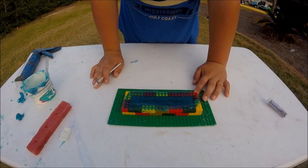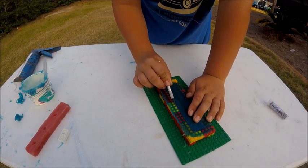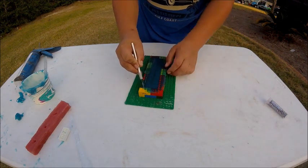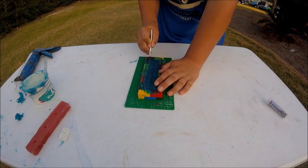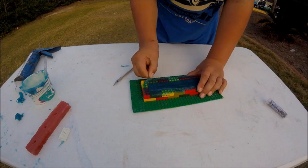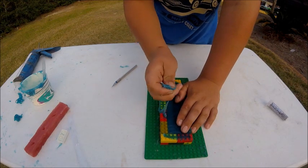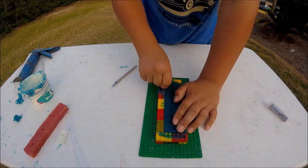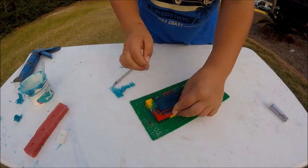Now since the mold has finished curing, all you have to do is cut all of this excess silicone off, and it will peel off hopefully all in one piece — it's been about 15 minutes. Get a knife and cut that off, and it'll peel right off. It might be hard getting around the Lego blocks, but see — peels right off and it's pretty easy.